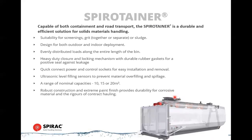And once the chute is retracted, a gate is closed to lock off, to make this airtight. And then it's picked up and taken away to the landfill. So as I said, these can be employed for screenings or grit, either together or separate, so they can be mixed and dumped in, or they can be for sludge removal as well. We have some plants that prefer to use this rather than trucking out sludge.